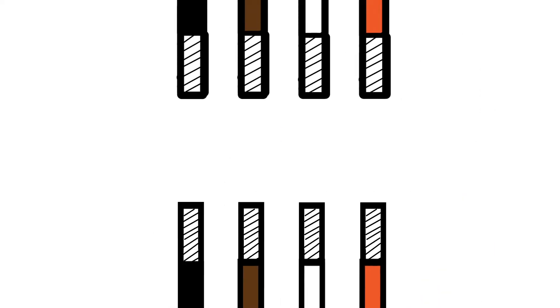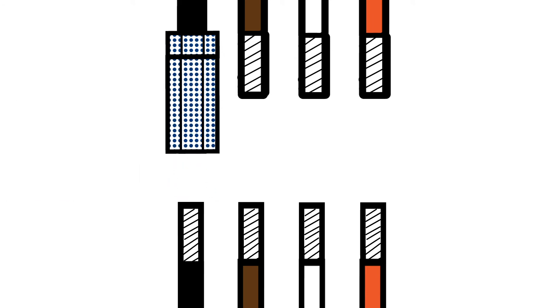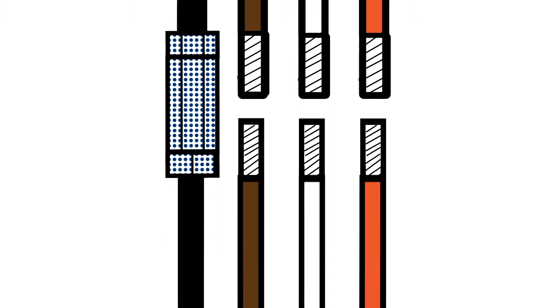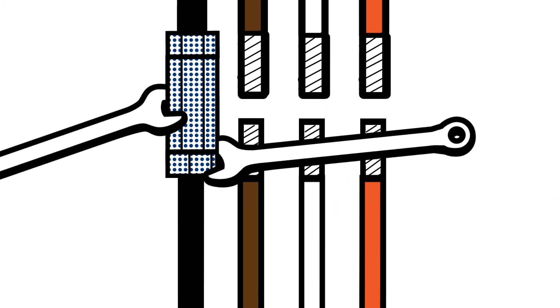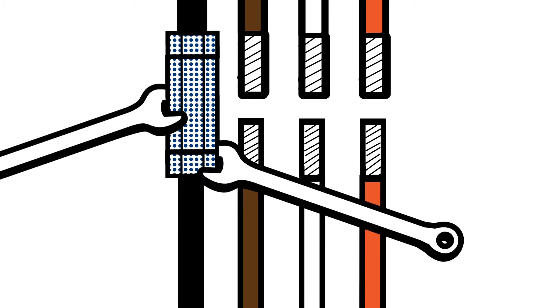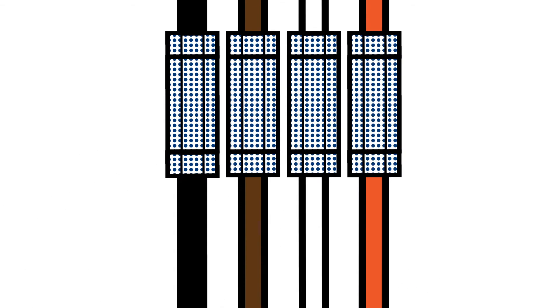Attach the extensions to the respective rod by using a jam nut from the bag in the kit, and twist it just below the heat shrink on the top rod of the sensor head. Next, take a coupler nut and twist it underneath the jam nut on the same rod. A second jam nut will be placed all the way onto the extension rod. Screw the rods together. Twist the bottom jam nut against the coupler. Use two wrenches to secure the coupler nut and bottom jam nut, making sure this entire assembly is tight.